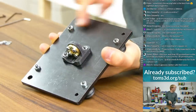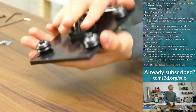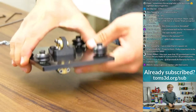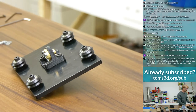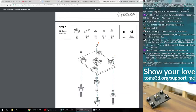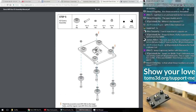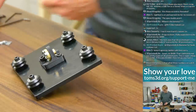Okay, these two are still loose, so we can still rotate these more or less and adjust them. It's still quite a hefty plate. Okay, step done: match the eccentric nuts to the larger holes. Yeah, okay, if you can't, drop the eccentric nuts into the smaller holes. Okay, that's done. Now more wheels on the rest of the holes. Okay, same thing, same story.